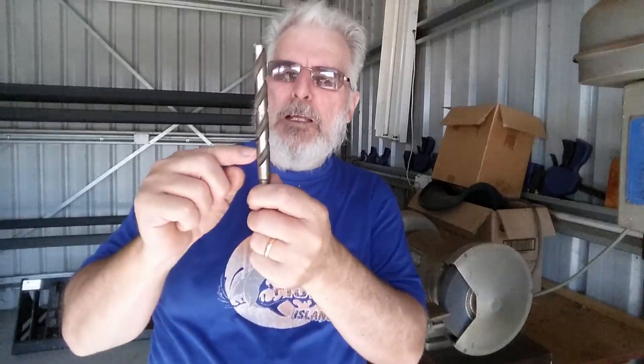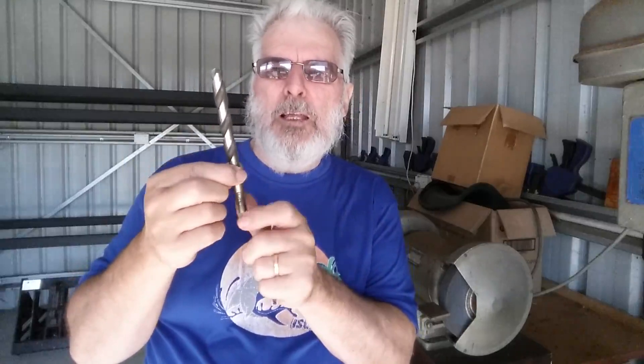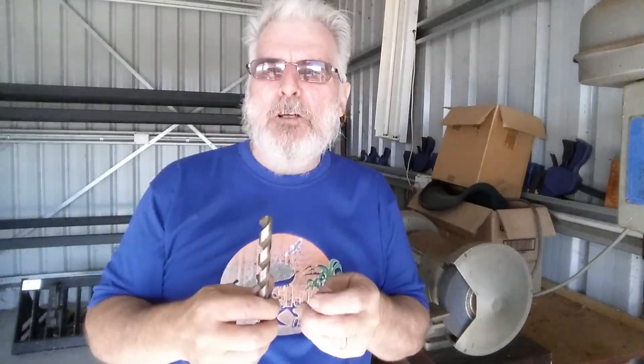I remember when I started at Teachers College, a lecturer got out a broken old drill bit, took a couple of edges off it, and said 'sharpen that up,' then gave it to the next student, who took a couple more edges off and sharpened it again — the drill bit got smaller and smaller. Keep in mind that the flat spot in the middle gets larger as you go back down the drill, so you need a larger pilot hole as it wears down. Also, the drill bit down at the shank end is soft so it doesn't damage your chuck. As you get lower you'll find the drill doesn't keep its edge as well and you need bigger pilot drills, but you can still use it right down to the end. So unless you break a drill bit, you can just keep sharpening it and away you go — have a go, it's really easy, and have fun!